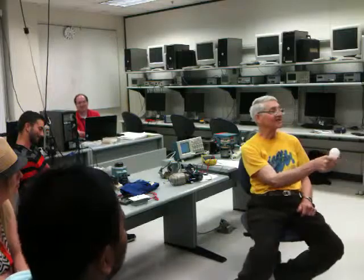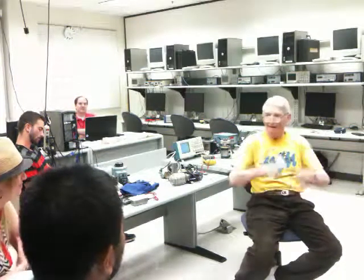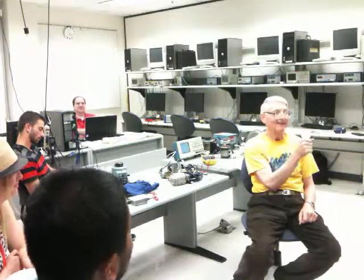Suppose I have you pedal this thing for 10 hours, because I need to have the light. I'm working at nighttime, it's winter time, and I need to be able to see, and so I've hired you to pedal and keep this light bright so that I can do my work. That's 1 kilowatt hour. How much is a kilowatt hour? Like 10 cents. 8 or 9 cents. So about a dime to keep it on for 10 hours, so it would have been 1 penny for the first hour. I suggest you continue being a mechanical engineer or whatever and get paid for that job rather than keep my light on.